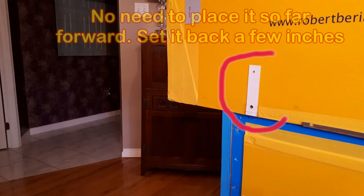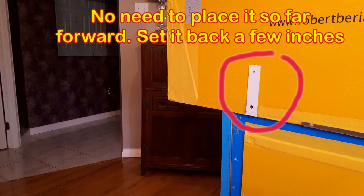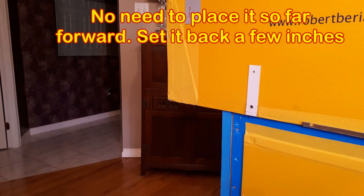After having installed the hood support rails, I needed to find a way to pull the hood forward so the rear second level wall would be tight against the side walls and to hold the hood in place so it wouldn't lift up and blow away in a strong wind. First, I had to reinforce the coroplast side by hot gluing a piece of aluminum sheet near the front of the hood as highlighted here.